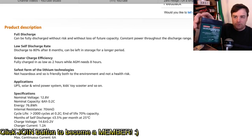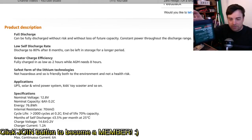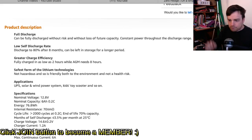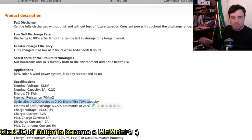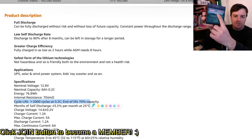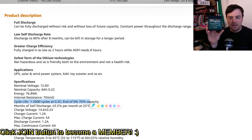Because they're such long-life batteries, it doesn't matter if you get one a couple of months, 12 months, or even two years down the road — you can safely parallel these and still have them work together, unlike lead acid. The life cycle spec is greater than 2000 cycles, and that's at a 0.2C rating. The C rating refers to the amp hour capacity, so 0.2 of the 6 amp hour rating — if you're only pulling 0.2C, which is 1.2 amps, you get your greater than 2000 life cycles.